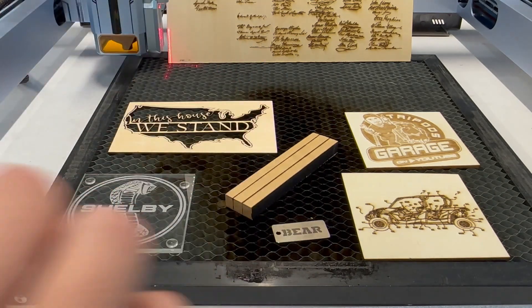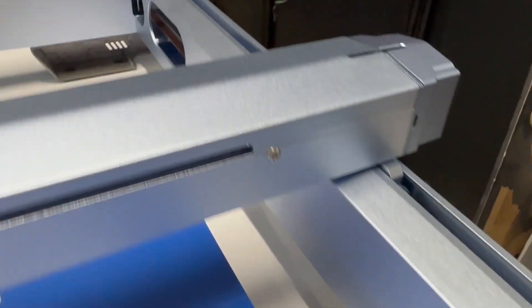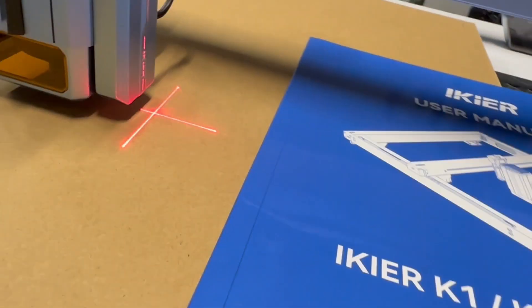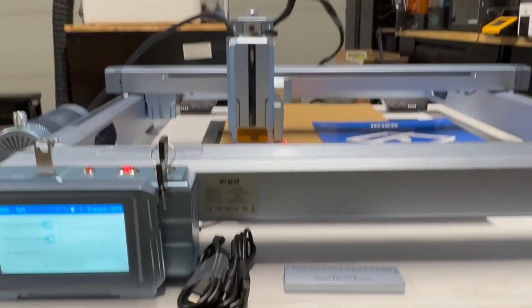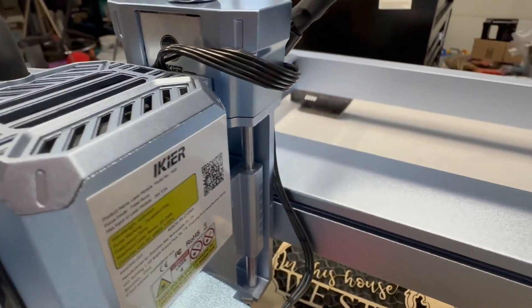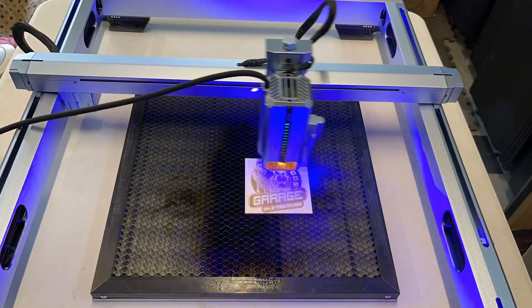So where are my thoughts on this iCare K1 Pro 24-watt laser engraver? Let me tell you — let's go over some of the pluses. You got a touchscreen that's somewhat usable. Construction is absolutely amazing. The wire management is really good. You've got the autofocus Z, and you have the infrared marking there to help outline your job positioning. The air assist is controlled by LightBurn — you just adjust the flow right there. Big key lock so kids don't get into it. As for the minuses, I had to be nitpicky here. This cord just needs to be a little bit longer — it chafes as the Z goes up and down. The mobile app definitely needs some work; it doesn't have any material settings, though it is very usable, and you can tell it's in its infancy.